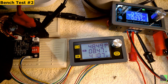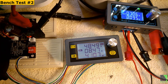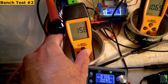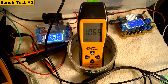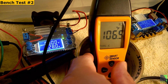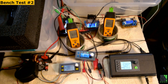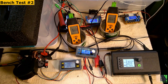Currently I've reduced the power to 410 watts for just the Peltier elements themselves. That isn't very much but I don't want to overdrive them — that would be a problem. The temperature of the air outlet is still about 60 degrees, 15.9 degrees Celsius, and the temperature of the water has crept up a little bit — it's 106.5 degrees Fahrenheit, 41.4 degrees Celsius. It is going up a little bit, however remember outside is very, very hot. Outside is the radiator setup — it's an updated one, I made it bigger.